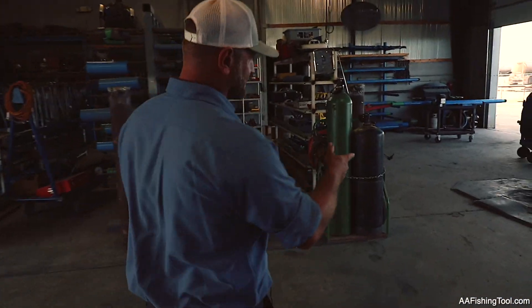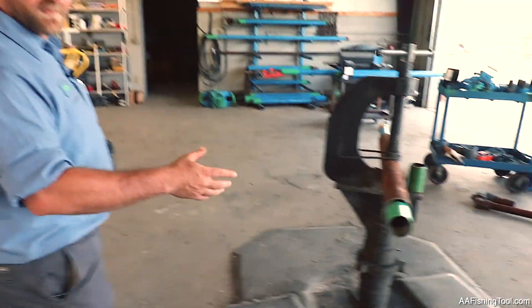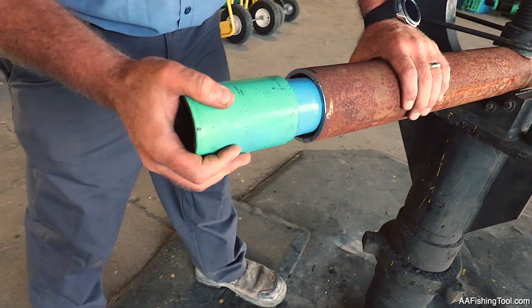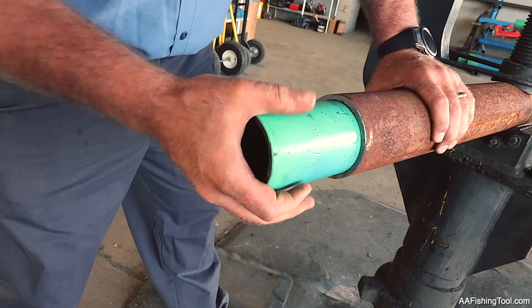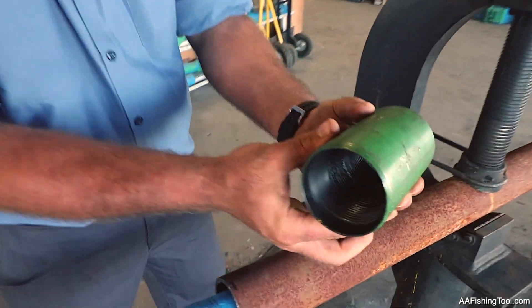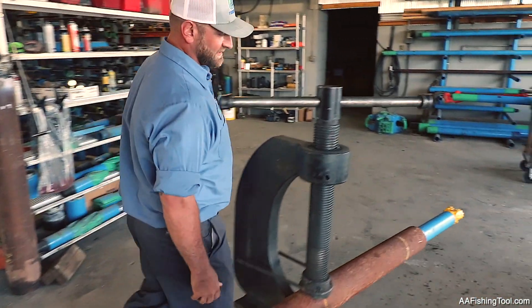What I have set up in the vise over here is an actual chunk of welded liner pipe, and I have a piece of two and three-eighths tubing in here with a full-size coupling, which, as you can tell, does not fit. That's why you'll have to go to a turn-down coupling, which will actually work inside there, but it has very little clearance, which makes it hard to drill with.